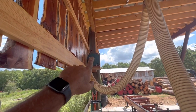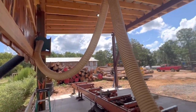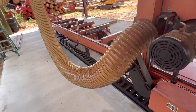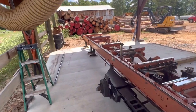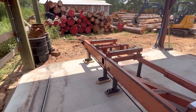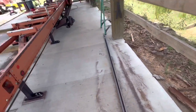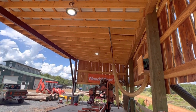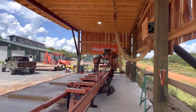There are some little fins on the front side — from time to time if I'm doing cypress or cedar, it will stop up a little bit and we'll have to pull it off and clean it. I've had no problem doing 8s, 12s, and 16s. Once I do longer — I'm able to do up to 27 with this bed extension — I'm going to have to extend that. So I'm going to take the additional track, get it on my flat concrete floor and MIG weld them together to make sure the tracks are exactly the same, then I'll be able to carry my suction hose the entire length without any problem.